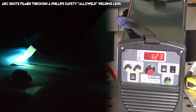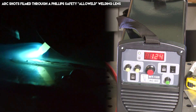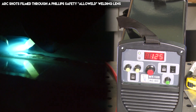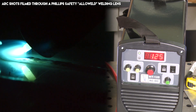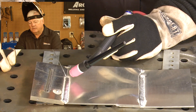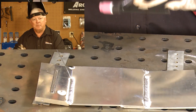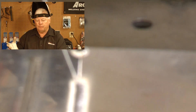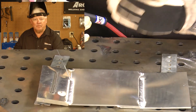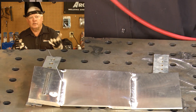I made the weld. You probably noticed I left the filler buried in the puddle — that's not uncommon if you're going to resume a weld, so I've got some 4043 stuck in there ready to continue on. Most of the time you're not welding that type of length — you're usually doing a tack, a repair, sometimes you're in tubing and you only do one inch at a time.